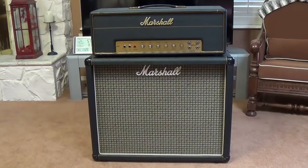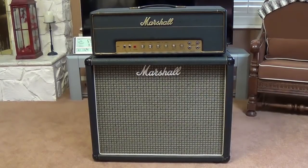Once I got started working on the circuit itself, though, I discovered that this is not a 1987 circuit. This is a 1986 bass amp circuit, which is the same as the other Marshall amp that I tested shortly after this one and compared to it. Not only that, but the set of NOS mustard caps was for a 1987 circuit and therefore was not appropriate for this one. I contemplated suicide and had great disappointment over the failure of my concept to come to fruition.